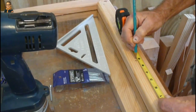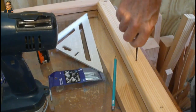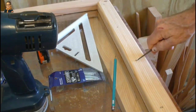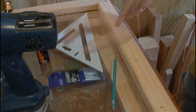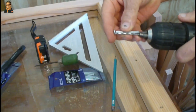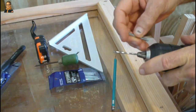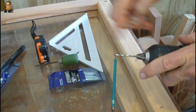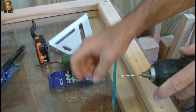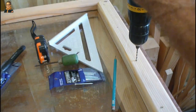I'm going to rough it out here — I'm going to say it's about seven and a half inches. I'm going to use the scribe, which also works as a nice hole-maker, to put a lead-in hole so the drill doesn't dance around before it goes in. Now, make the holes no deeper than the screws. If you have a drill stop, I can adjust where to put the drill and then just snug it down. I don't want the drill going any deeper than the screw because it'll weaken the hole — it won't weaken the screw, but it'll weaken its effect. So now I'm going to make sure, very sure, that it's nice and straight.